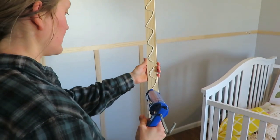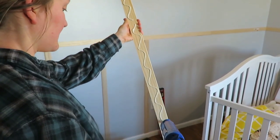Set your miter saw to a 30-degree angle with the board tipped up to cut the angle correctly. We cut all the boards at 30 degrees on the bottom, then measured each board individually as we went around the room and cut only the top portion. That was much easier since walls and floors aren't even — you can't pre-cut everything at once and expect it to fit. We kept liquid-nailing and nail-gunning as we went; my husband was cutting and I was doing the nailing, so the project went quite fast.